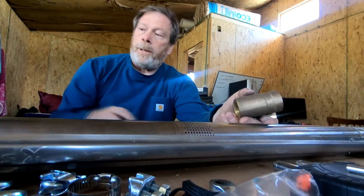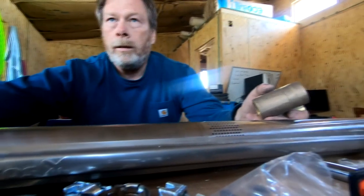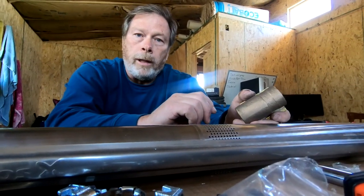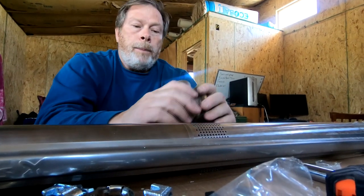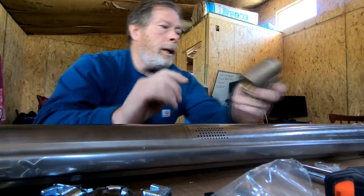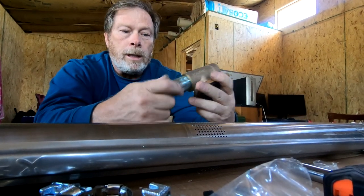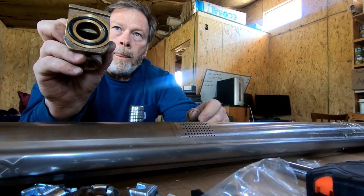So, the next step is to go ahead and tape the rope, the wire, and the tubing together about every 10 feet going up until we get to the full length. And we'll do that as we sink the pump. But the final connection will be the black tubing to another bushing, which goes into this pitless adapter. This is the pitless adapter. I don't understand what that is. Okay.